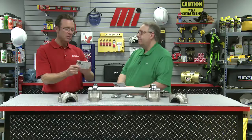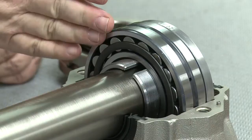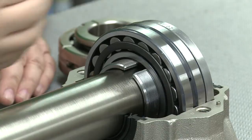What are we looking for in terms of numbers on our chart? Since this is a 65 millimeter bore bearing, we will need to move the bearing up the taper adapter sleeve 20 to 28 thousandths of an inch using the lock nuts that came supplied with the adapter sleeve. This chart is a great resource for that. One way to determine the center is to place the bearing in its resting position on the adapter sleeve and measure from the end of the adapter sleeve threads to the bearing's inner ring. Then measure one half of the width of the bearing and add that to the 20 to 28 thousandths of an inch more that the bearing will be moved up the adapter sleeve — this gives us the center spot where the bearing will be sitting. Measure, add, and check.